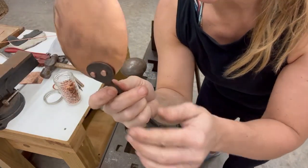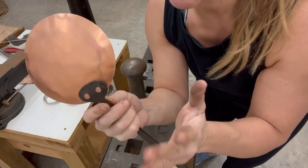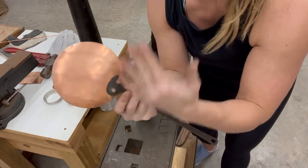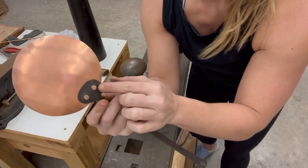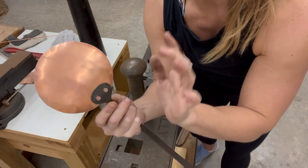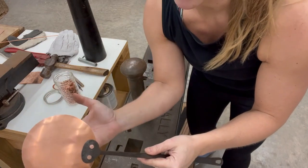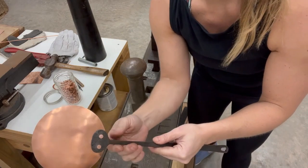We have a nice tight handle and flat rivets on the inside, which is exactly what we want. Now, when you hand-hammer rivets, they mushroom — I'm doing it this way because not everybody has the tools to do round-headed rivets, but everybody has a hammer. The rivets are going to be a little sharp on the very edges where they've mushroomed, so now the little detailing comes in. We're going to clean that up using a Dremel or some sort of mechanical sanding — that's ideal.